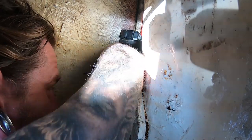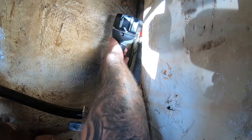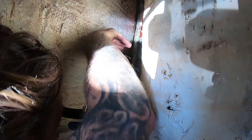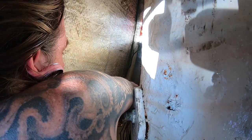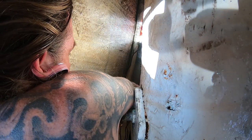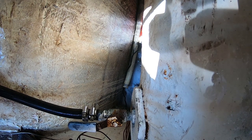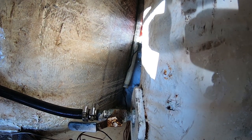I use really short screws out of fear — because with a cored boat you can quickly drill into the core. The manual for the new one says when you drill that hole, take the screw back out and use ABYC-approved sealant so there's no water intrusion into your core. I don't have to worry about that because that's solid fiberglass.